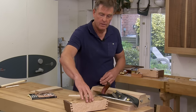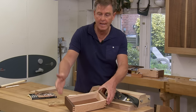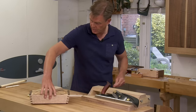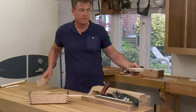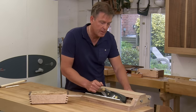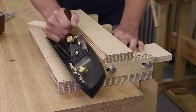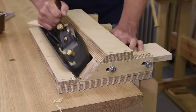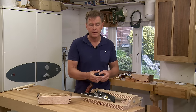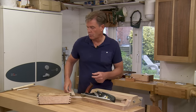You can work really accurately right down to your line for a perfect fit. Now if you've got an angled box where the linings are shot in at a 10-degree angle to match the angle of the dovetails, that's simply achieved by taking a 10-degree wedge and offering this up — bring it forward to the front of the plane. And in the same way you can shoot your mitres to fit the inside of the angled box.